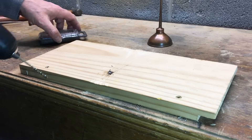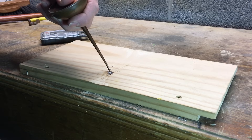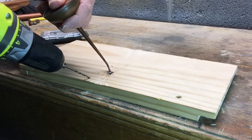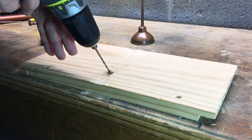I was going to use a number one on this, but I should size it up a little bit to a number two because this is almost a quarter of an inch. We're going to get some more oil in there, consider this a pilot hole, drill that out a little bit more, and go to a number two Easy Out.